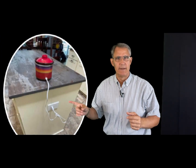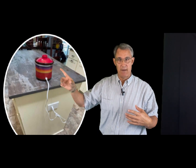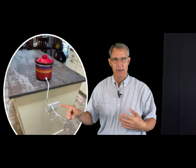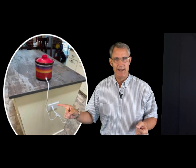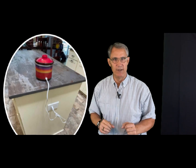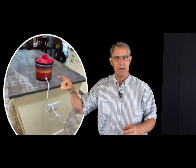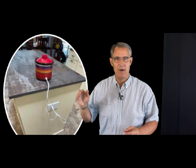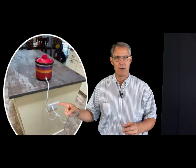So this is it. At the very beginning, I showed you this picture — the queso that my wife is cooking up — that's acceptable. But what's not is this: my island in my house, according to the codebook, is no longer acceptable. This is within the old rules where we could mount them below the countertop within 12 inches. That rule is no longer in the codebook. These outlets have to be on the surface of the countertop. They cannot be below the surface of the countertop, or they can be up to 20 inches above. They can no longer go in the sides.